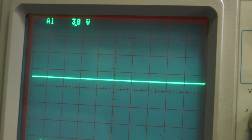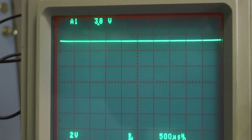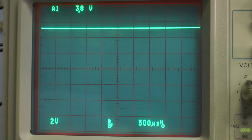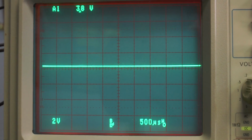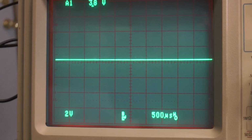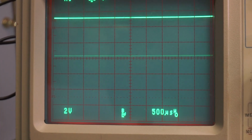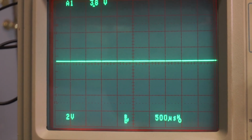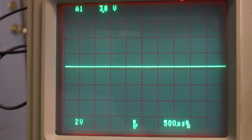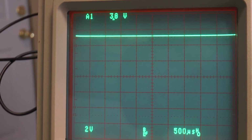You smooth it out just before the comparator, and then the output of the comparator, which is set high, goes low, and that's what triggers the timer. It's like a Schmitt trigger setup. So when it flips, it flips pretty good, and it's got some hysteresis too. So even though the signal trips at a certain level, when the signal goes down, it's got to go down several dB before it flips back up. That's kind of how the audio is processed through this thing.